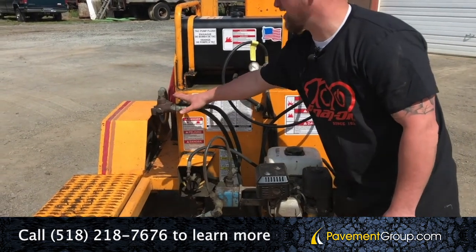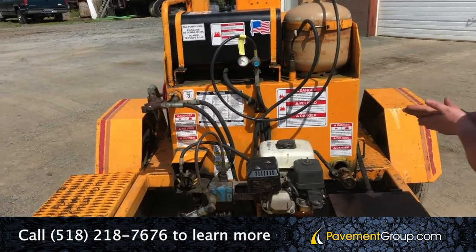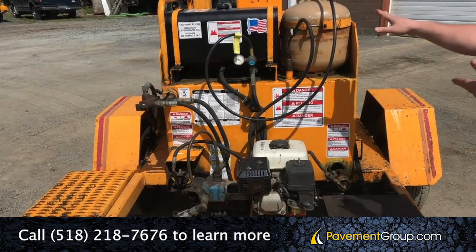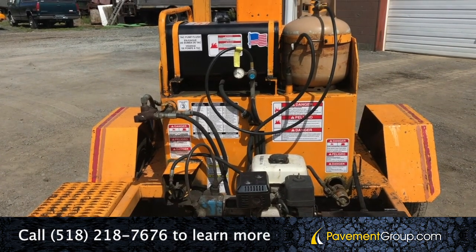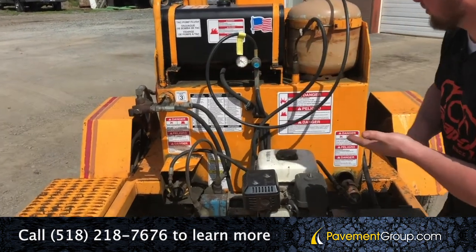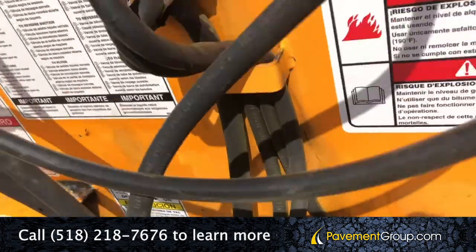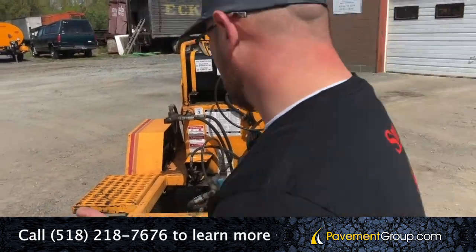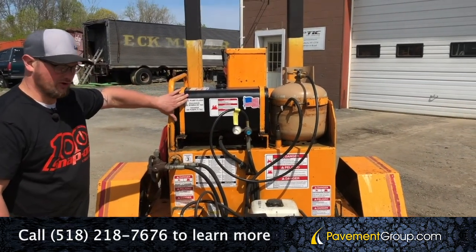It either diverts back to the tank, or you can use another valve to divert it to the ceiling hose. This has two 54,000 BTU propane burners, which you'll get your propane from a 30-gallon cylinder up top there — that is not included with the machine but can be purchased separately. You have a pressure gauge for how much propane you're running, and a material thermometer to show you how hot the material is inside the tank, just in the middle down below there. On the top there's a 10-gallon solvent tank used for flushing out the system when you're done working for the day.